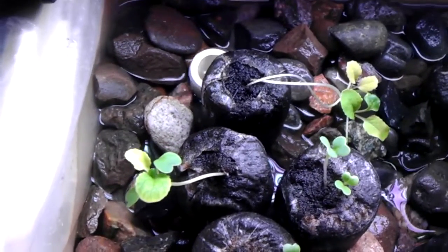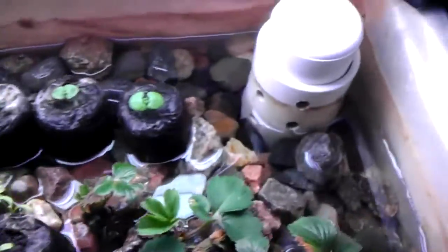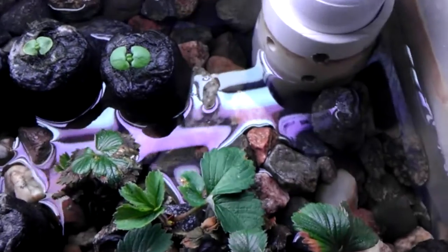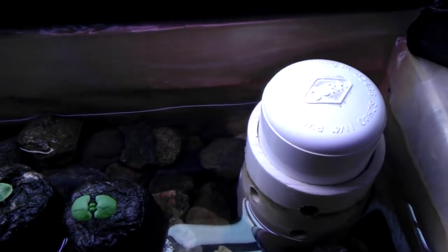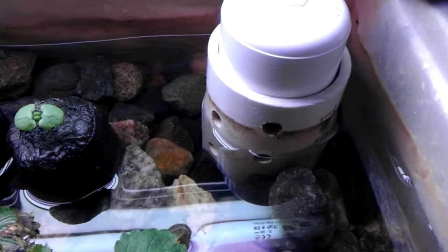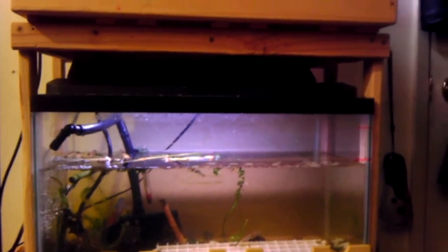I've taken off the PVC ball valve and simplified my inlet. I should probably simplify this further and just go with a regular overflow standpipe, but right now I have it running on a one-and-a-quarter inch PVC bell siphon with a half-inch standpipe and a two-inch gravel guard — that works fine for now. I know a lot of people just run a timer and overflow. I've also added a little stand and put the old 10-gallon lid back on.